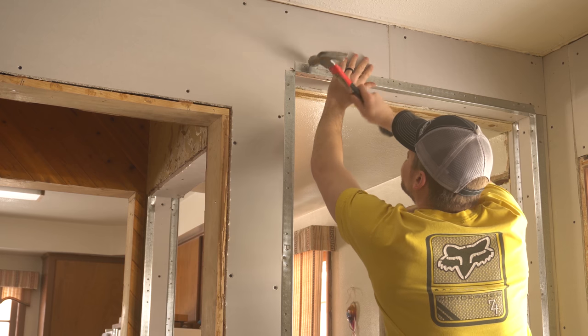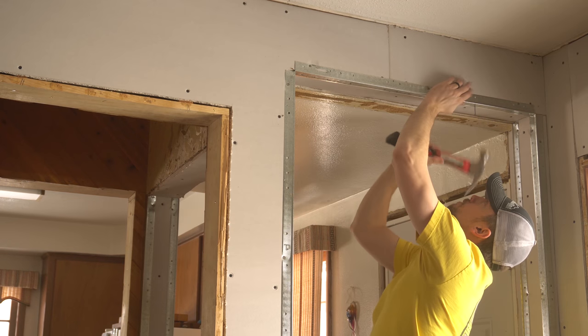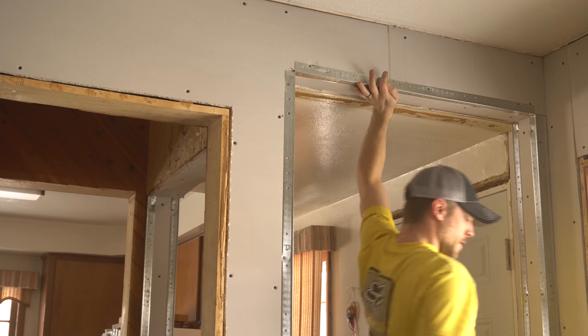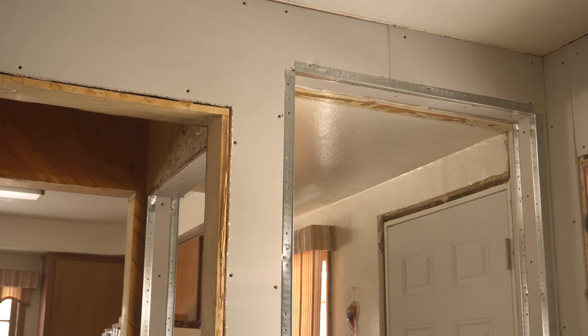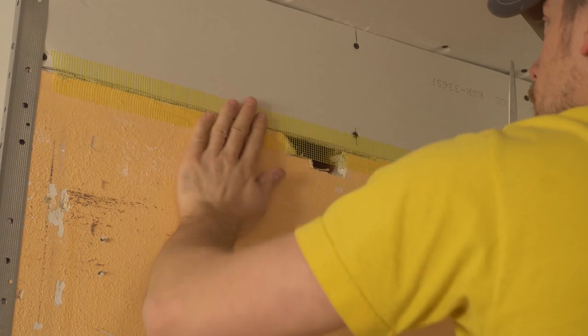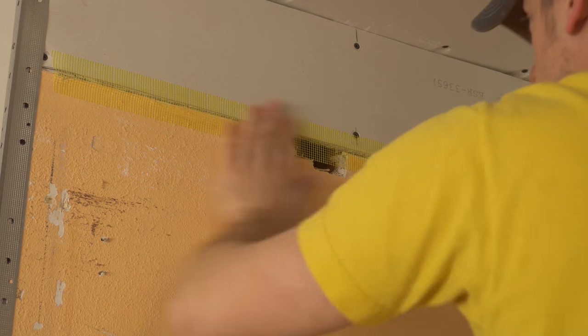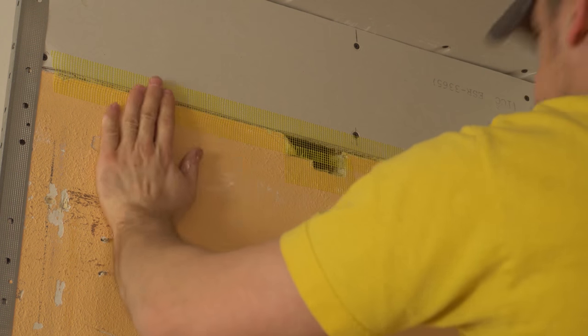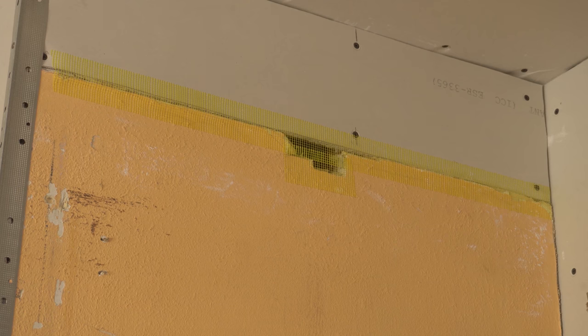At this time of the day, Katie and the boys are all taking a nap in the next room, and I really didn't want to wake them up. Have you ever tried to hammer quietly? It's not possible. In this one spot, I had a wide seam and a chunk missing from some overzealous demolition. Using mesh tape helps fill these bigger voids by adding a little structure to the mud that gets pushed through it — think of it a little bit like using rebar in concrete.